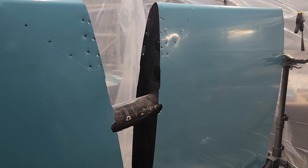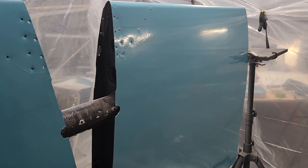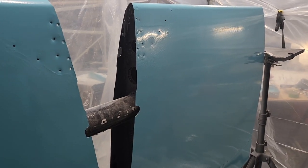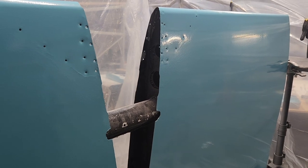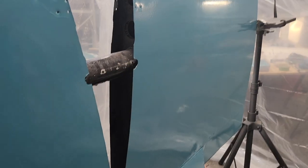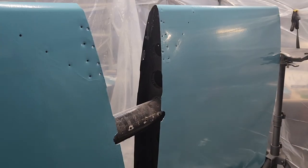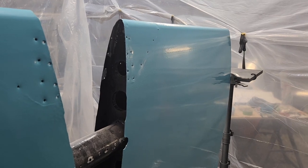So I use those, if I didn't cover it before, I use the mohair. I think they're made by a company called Red Tree. They're mohair rollers. I couldn't find any locally. I had to get them on Amazon. I kind of followed the advice of that boat painting guy on YouTube, and I used masking tape to pull off the few little pieces of fuzz and stuff that might be on the brush, and it worked like a charm. There's nothing in the paint. I'll probably find little tiny mistakes here and there, and probably little specks of dust, but for the most part, I'm much happier with this, and so that means I'm not really going to bother with the vinyl that I was going to use before.